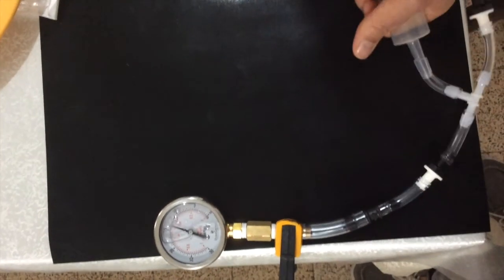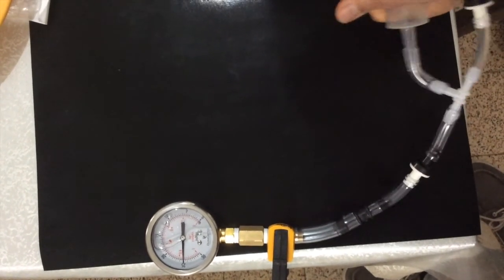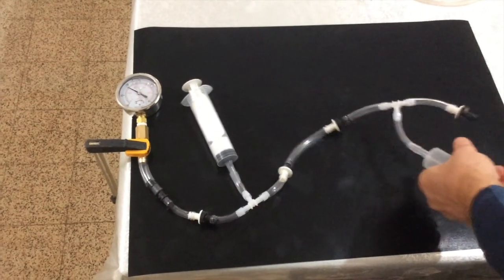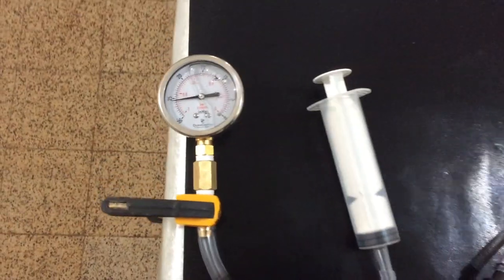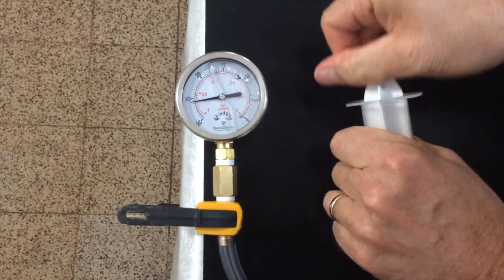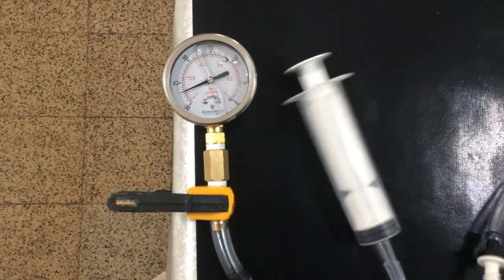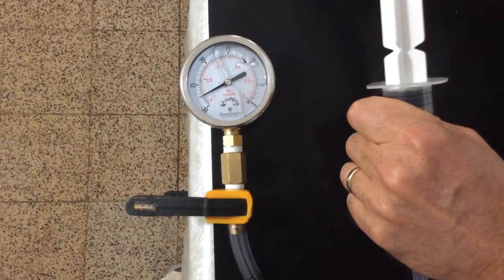With a single-stage system, it is possible to get to 26 inches mercury, but additional pumping does not improve the vacuum pressure. Now, using a two-stage system, we repeat the process for a single pump on the right. You can see that we once again get to about 26 inches mercury and no better. But then using the pump on the left, we can improve the vacuum pressure pretty significantly. However, doing these processes in reverse does not improve the pressure.